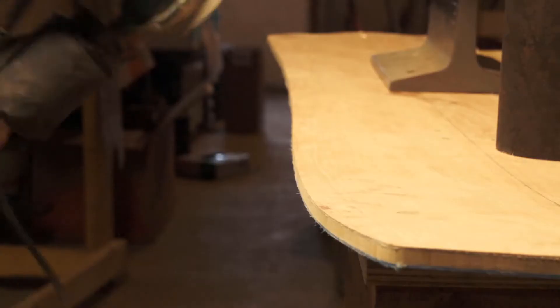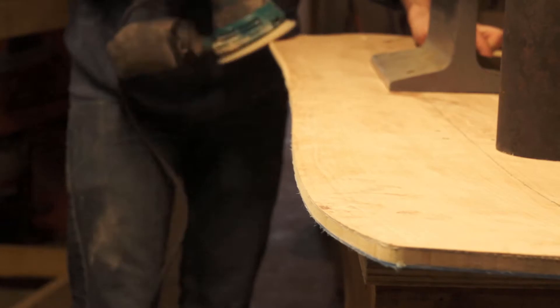The next thing I wanted to tackle was rounding the rails. Since we don't have a sidewall, a standard snowboard chamfer would introduce stress points, so I want to give it a nice curve. I could use a roundover bit on a router, but I like rounding my rails by hand — it makes more pleasant shapes to the eye and to the touch. It harkens back to shapers in the surfboard community. This isn't a production run, we can be artistic. Hand-shaping the rails is one of the small joys of the build, so I grabbed a random orbital sander with an 80-grit pad and went to town.